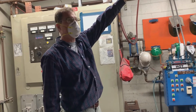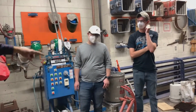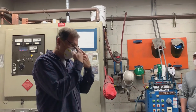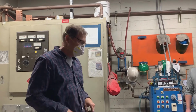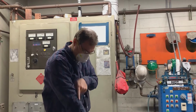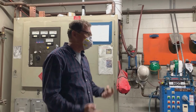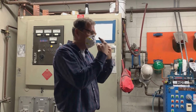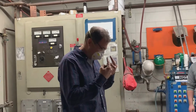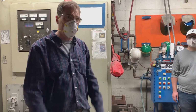We've actually had these lights taken out by someone doing that. We poured molten rods into an ingot mold. It took the light out. It went up under his face shield. It literally splattered on his 2 glasses. It went in his beard. It went up, came back down his neck, came back down his glove. Okay. Now, what he was kissing the ground about was the fact that I had just made him put his safety glasses on underneath his face shield, because it went up under the face shield. And I kid you not, we used to have them on the wall. There was a splash on either one of them right where his eyeballs were.